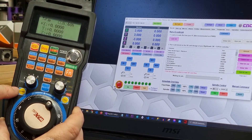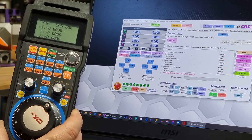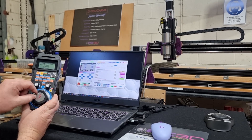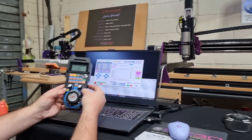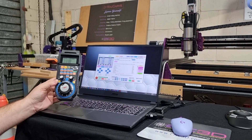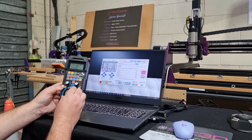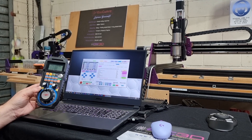There is a continuous button at the bottom and a step button on this side as well. If we press the continuous button — currently set to X — we can simply wind this wheel and see the X axis moving and jogging exactly as we'd expect. Now if we hit the step button, it takes into account the distance you wish to travel. At the moment this is set to 10 millimeters, so turning this one notch will move exactly that 10 millimeter distance.